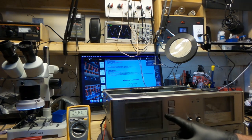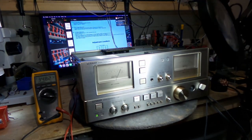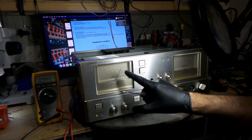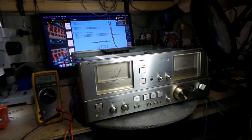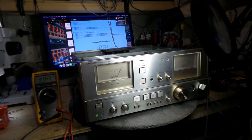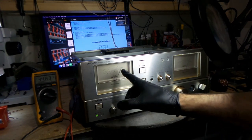Bring this down. And then my lighting is really not that great on this, but this should be set to 0 decibel or 150 watts. That's what I'm getting, so we'll need to adjust this, and we're doing the left channel. So I've set this to 0. It wasn't quite at 0, but now it's at 150. Okay, so this is set properly.